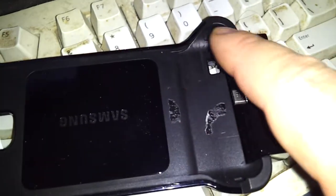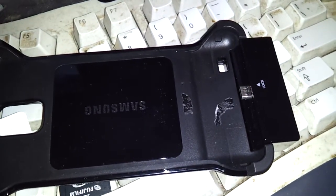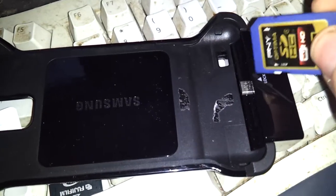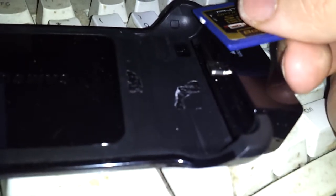And then, of course, I will grind this down to allow the USB jack to engage, and to allow me to remove it, I'm going to leave these a friction fit, and I'm going to add a piece of plastic to this here so that it'll overlap just like that. It'll be a flat black piece of plastic as wide as the front of this part here is, so that when it's down like this, it won't engage the phone. But when it's closed, it'll engage the bottom face of the phone. And now the phone will be positively locked into the cradle like it's supposed to be.